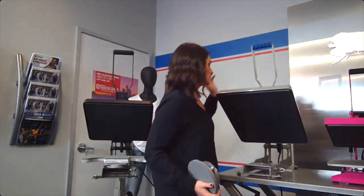A lot of people ask what press size they should get. This 16 by 20 is the press I recommend because you can never make your heating element larger, but you can always make it smaller by changing the bottom platen. So if you want something smaller, just swap the lower platen. But the heating element — the top — can never be changed. You can always make your print space smaller, but you can never make it bigger. That's why I always say go with the 16 by 20.